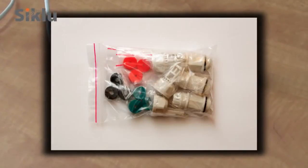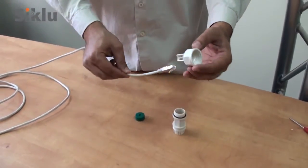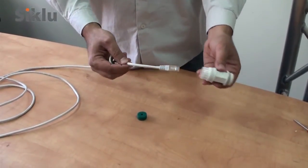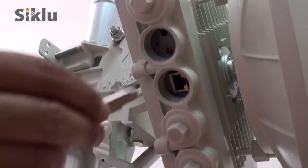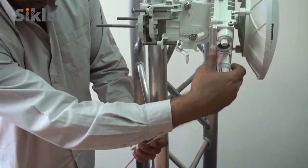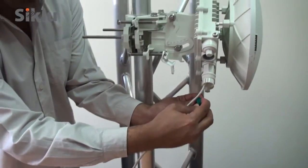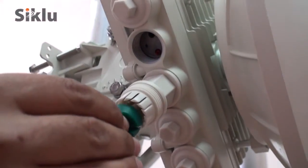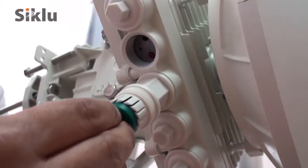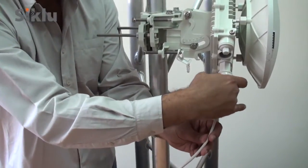Three sets of protective all-weather shells are provided in each ODU box. These fit cables from 3.5 to 9mm in diameter. Connect the Ethernet cable to port RJ1 of the ODU. Select a rubber gasket that best fits the cable diameter. Note that the rubber gasket is spliced and can be assembled on cables with connectors. Secure the all-weather shells by hand only — do not use tools.